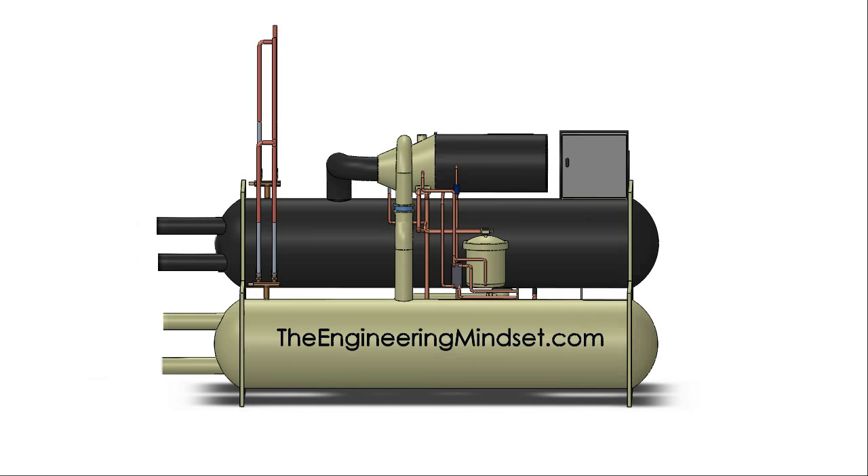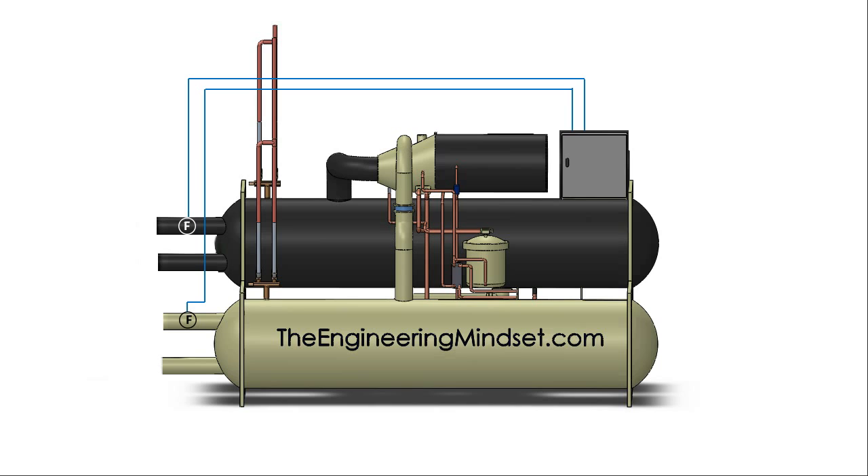So let's have a look at what some of these are. First, we want to know how the chilled water and condenser water loops are behaving. The chiller needs to know that there is water flowing in the evaporator and the condenser water loops. The chiller will not start if there is inadequate flow — this is to protect the chiller from freezing and bursting the heat exchanger tubes inside these vessels. So the chiller will normally have flow sensors connected onto these, feeding back to the control box.